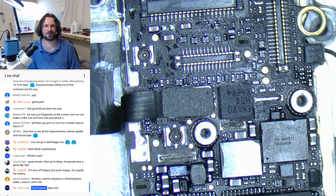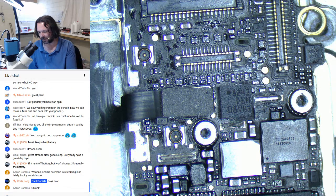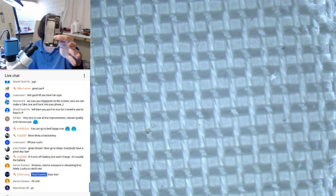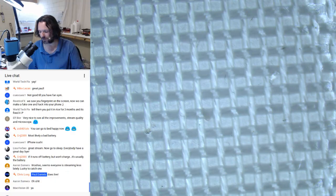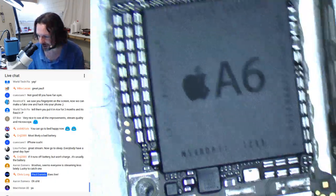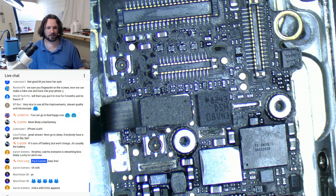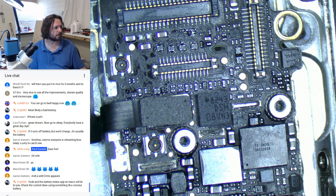Oh, geez, Chris Long, I was just talking about you, and you just missed the end. Well, it's working, Chris. The phone is working. It's an iPhone 5. It was water damaged for about 2 years, and we got it to work. I almost pulled the PMIC off, but WorldFix stopped me, thank God, and it ended up just being a rogue cap that we found using freeze spray.